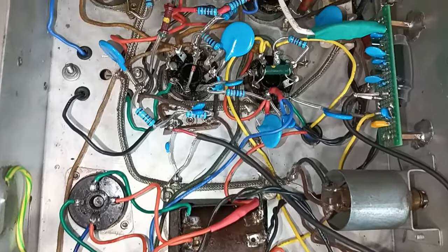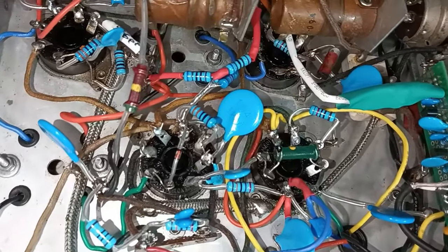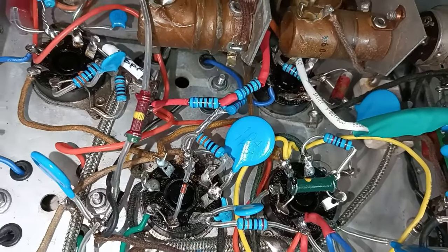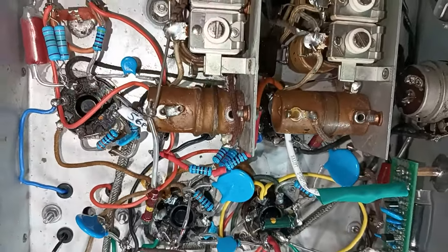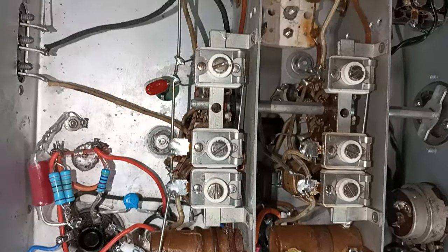This junior ham receiver does not have an antenna preamplifier stage that could filter the tuned signal sufficiently for avoiding the reception of image frequencies. Therefore, a strong station can appear on the dial where it is supposed to be, according to the transmission frequency, but also twice the IF frequency below.